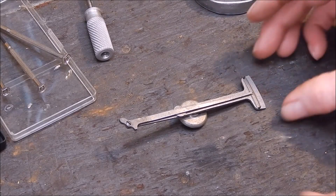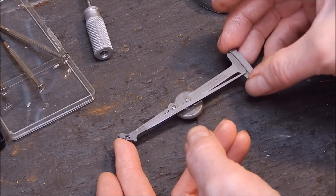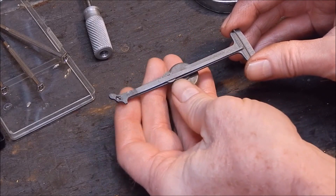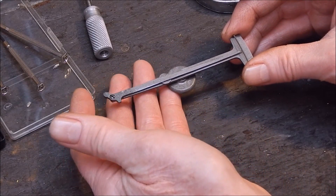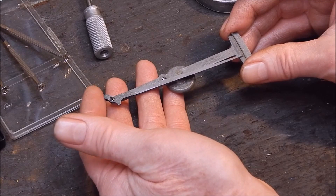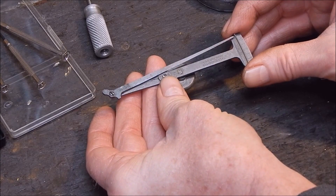All the bits are cleaned up - what a great job that did! They're now soaking in water to neutralize the acid and get rid of that. It's a far cry from what it was when I got it. The way it works is you centre it with this little wheel here - the spring goes off of that up to here and that's how you actually centre the thing. It's got little serrations on the edge. You use these in the horizontal position and then the probe just touches inside or outside depending on how you do it. It's quite sensitive - you can see how it's designed to work.